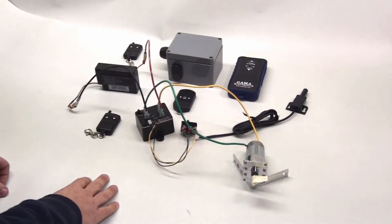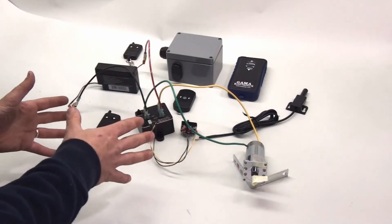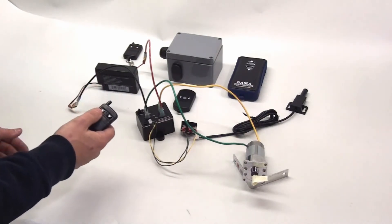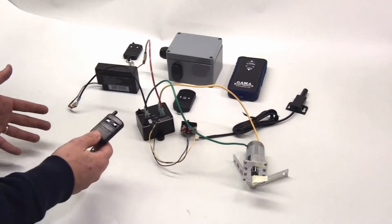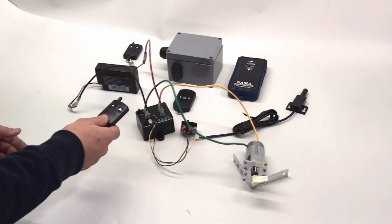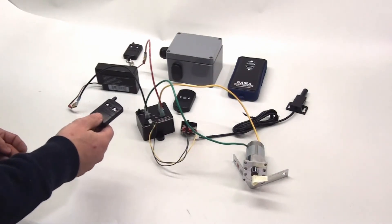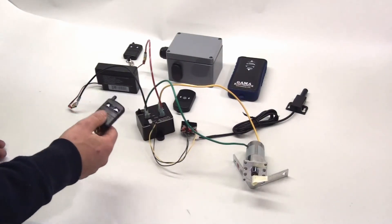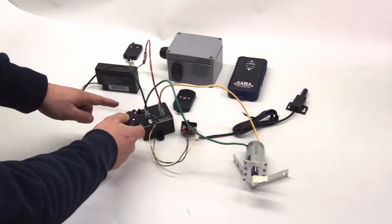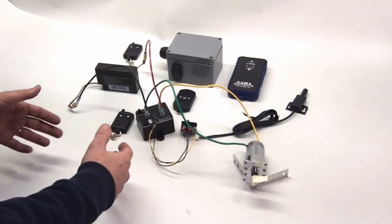The rechargeable transmitter: just plug it in and you're ready to go. If you've changed the battery and still aren't getting transmission, you may be standing too close to the receiver. Our transmitters produce a very strong RF signal, and if you're right on top of the receiver it can overwhelm it. Take a few steps back — about three to five feet — and it should work fine. This also happens when programming: hold the transmitter about an arm's length away.